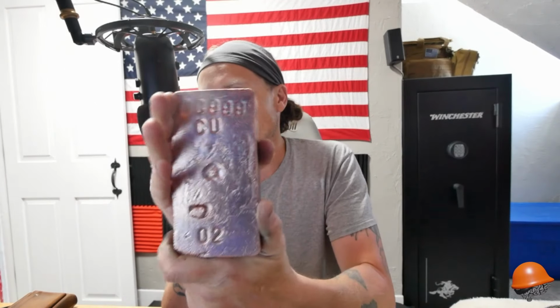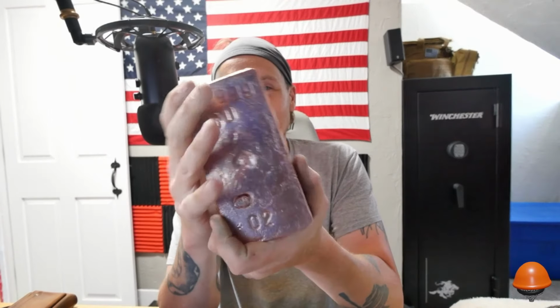You just can't hesitate on your pours. That's why I got these little dimples. You see these dimples here? It's because you got to keep the ingot mold piping hot. And when you go to pour, you can't hesitate. You have to just do it. But I was scared to lose my precious copper drops. So I hesitated on this one a bit. And I got a couple little dimples, but it adds character.